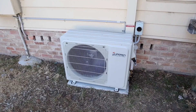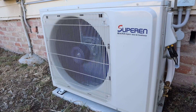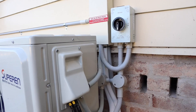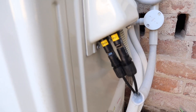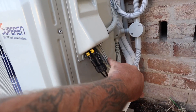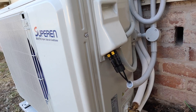We're just at the outdoor unit now — that's the conduit and wiring running back up into the internals of the house. It's a very quiet unit as well, which is really good. We've got our solar isolator here and there's also an isolator on the roof. Here are your positive and negative PV connectors running into the side of the unit. You can also run AC, but we don't have the AC hooked up yet — right now it's purely running off the PV connectors.